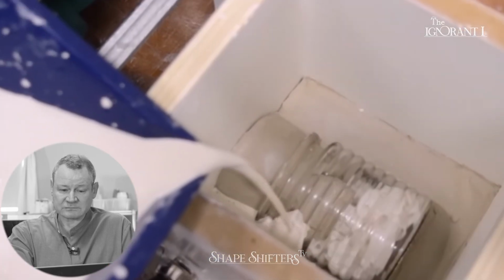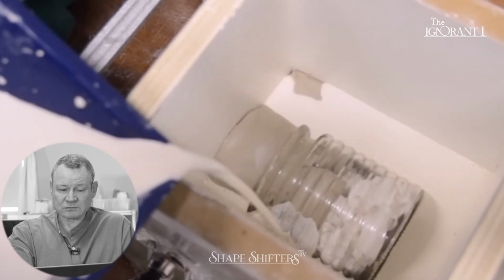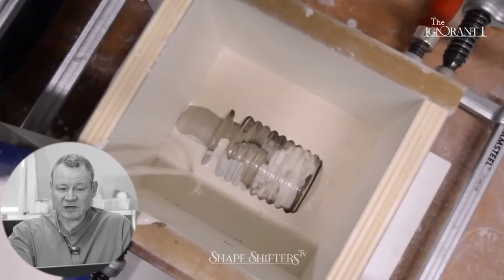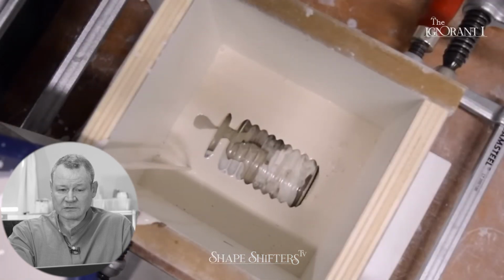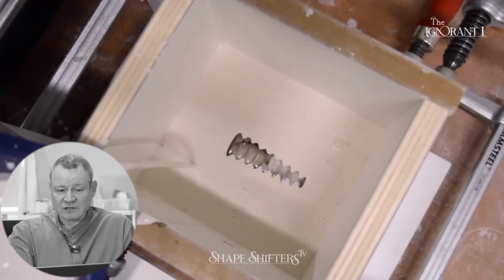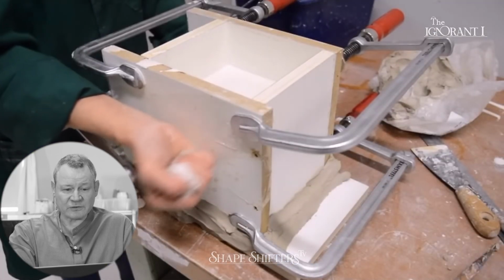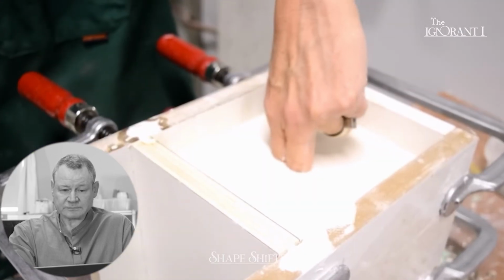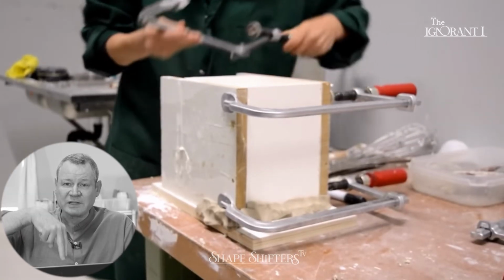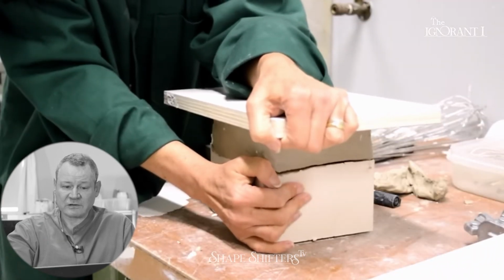The plaster should be poured in the corners or lowest points of the container, and it's a little too watery on the pour. You can see all the air bubbles in there. She didn't have a pouring indication line, so now she's got to fly blind or have a reason to put a stick in there or something. Doesn't do anything. Now your fingers are, see how it was milky? That meant that her plaster was poured too soon. You shouldn't have been able to see her finger.